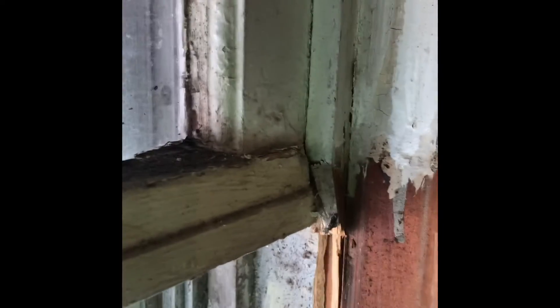There's a little piece stuck in there but that'll come out with the next section — you can basically just crack it off. That center stop, once you remove it up to where the top sash is, you can pull down on the top sash and wiggle it out from the bottom. The bottom is also going to have the counterbalance or the springs. You're going to probably want to have the top sash close to the top, maybe about in this area, before trying to pry those off. We're going to do the same thing as we did for the bottom sash — pry this out and continue with the center stop.